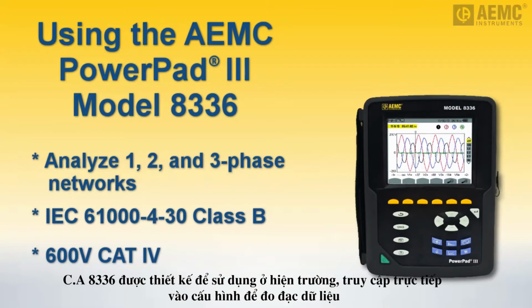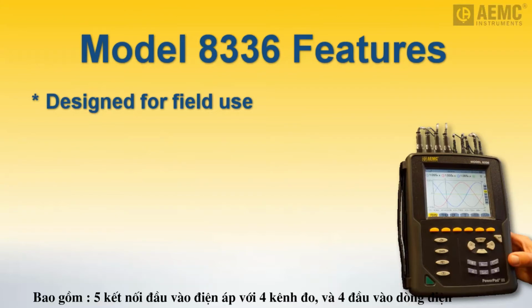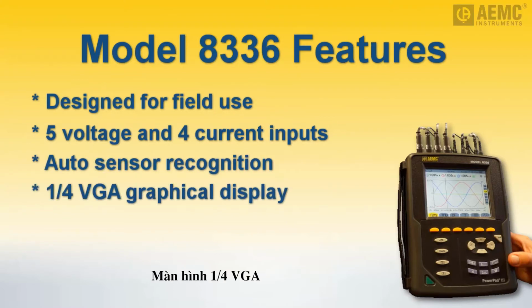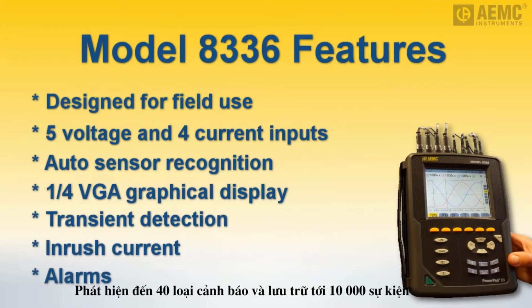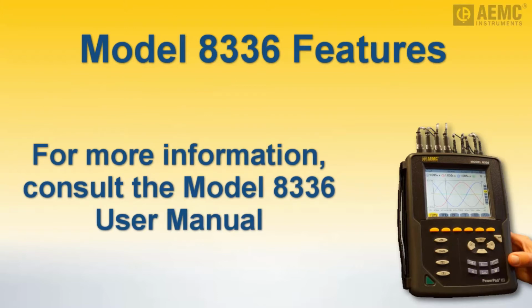The Model 8336 is designed for use in the field, with direct access to configuration and measurement data. It includes 5 voltage input connections, facilitating 4 voltage measurement channels, and 4 current input connections for 4 current measurement channels, automatic current sensor recognition, 1/4 VGA graphical display, the ability to identify and record up to 210 transient measurements, true inrush current detection, and options for configuring and detecting up to 40 different alarms, with the ability to store 10,000 events. These are just a few of the Model 8336's capabilities. For details on all its features and functionality, consult the documentation that comes with the instrument.